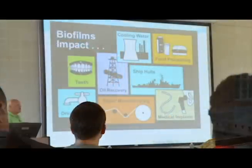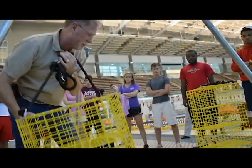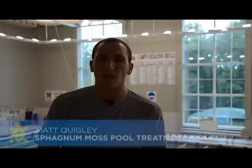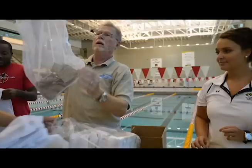The moss helps inhibit the growth of bacteria, various microorganisms, algae, and different waterborne agents, so we don't have to use as much chlorine to treat the pool water. We also have to backwash the filters less because we don't have those bacteria and algae. We use about 75% less water annually. Backwashing is the process of reversing the flow of water to wash the filters — water we usually just discard because we can't reuse it.